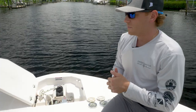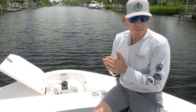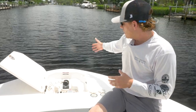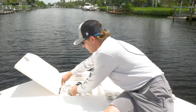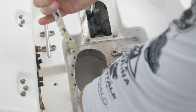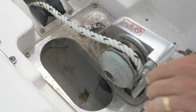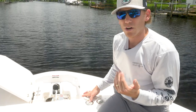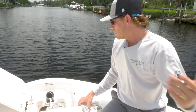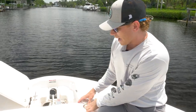Now let's fast forward — we're getting ready to leave. First thing, always start your vessel. If we have two people on board, this is always easiest with a second set of hands. Give some bumps forward to take some slack off the line. But if we did our job and tied that line with no tension on it, we're not going to start losing line. We're going to simply feed this back into our windlass and start retrieving the anchor. It's super important that we're taking that slack off the line — we need to get some momentum going forward so there's no tension being put on the windlass or chafing away at our line.